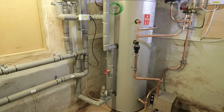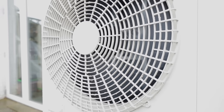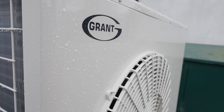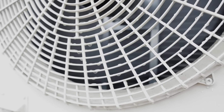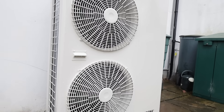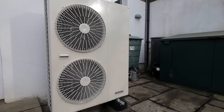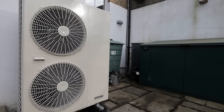By now you should start to appreciate the multistage process of a heat pump installation. We always start with a site survey and room by room heat loss calculations, followed by system design and heat pump and emitter sizing. You may have to upgrade some pipework and your existing electrical supply. More often than not some existing radiators will have to be upgraded to allow the system to operate correctly at lower temperatures. The whole process needs to be done carefully from start to finish - fail at any of those steps and you will get the answer to the question of why heat pumps don't work.